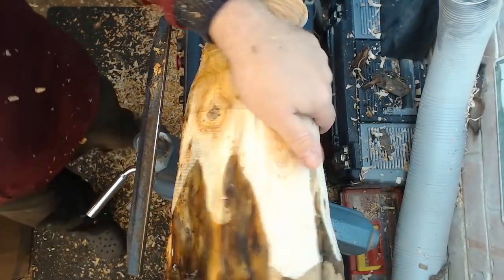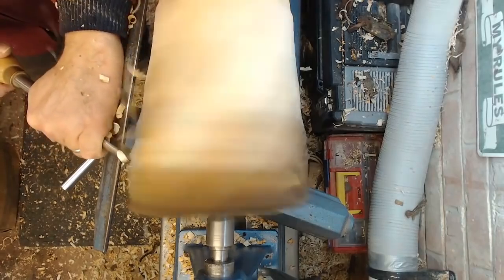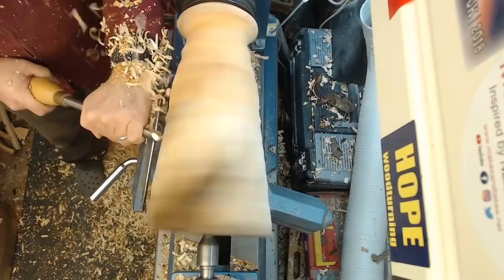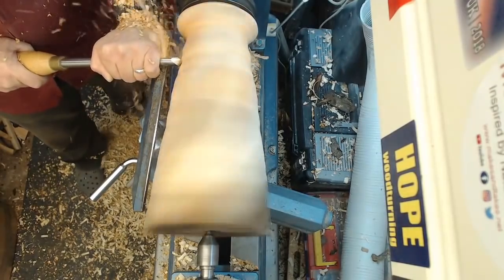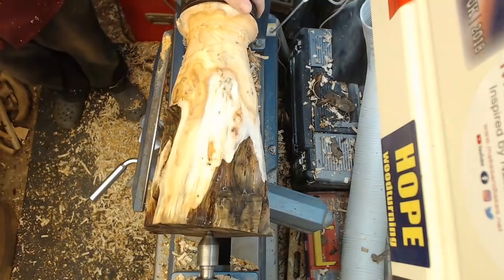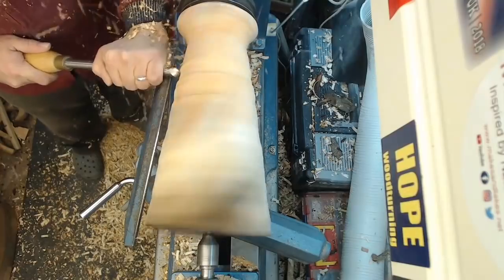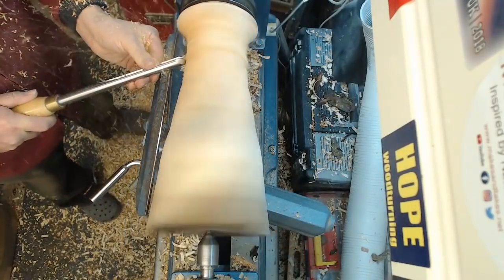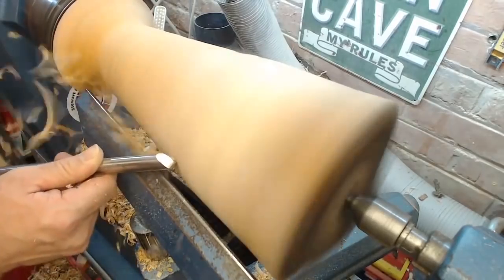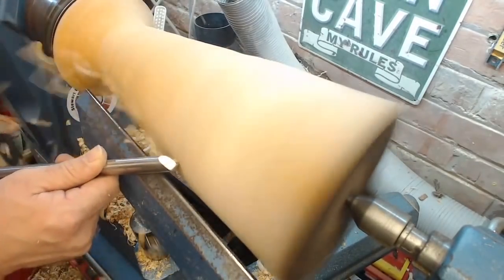Going to come up to the very top now. Repositioning the camera — using a pull cut on the top end, and here you can see the whole log and the shape is beginning to become clear. It's a very simple shape; I didn't really want to put anything complicated in here because I think the wood speaks for itself. If there's one thing I love about yew, it is the variety of color, texture, shape, swirl, and pattern within it — it really is a very attractive wood to work. Maybe a little bit too much sap left, but I didn't want to make it too thin. With a slightly finer cut, the gouge is not bouncing around nearly as much now and the shape is just about there.